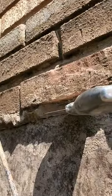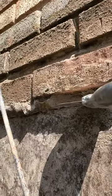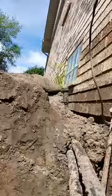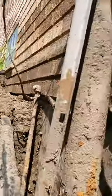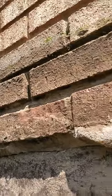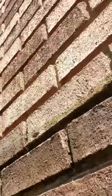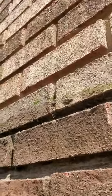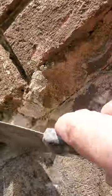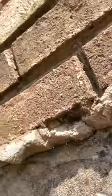One other little thing — the brick ledge is below grade. You see my scraper in the crevice, and you've got this crevice. What worries me a little bit is going forward around the rest of your house. You can see the mortar, how loose it is here. I'm barely touching this and it's moving. So I'll pop that out too. All right, thank you, sir.